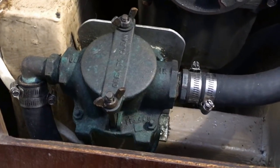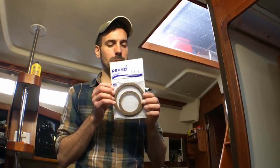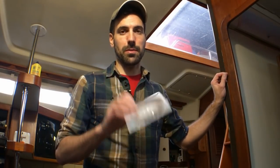We had a day where the power went out and I had to run my engine. I opened the sea cock to my sea strainer to let the water through into the engine. After maybe 20 minutes of running the engine, I noticed water leaking out of my Perko sea strainer — not a lot, just a trickle coming out from where the seal is. I picked up a new pack of Perko sea strainer seals, and I was lucky that my local boat store had the exact seals I was looking for.